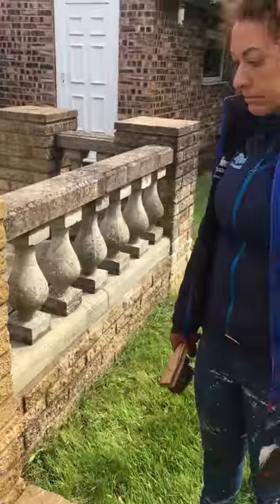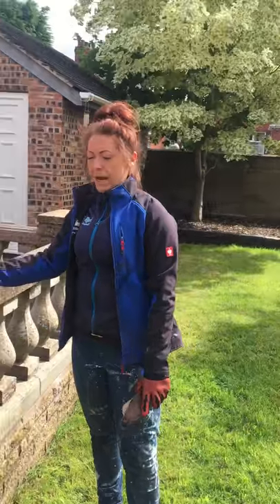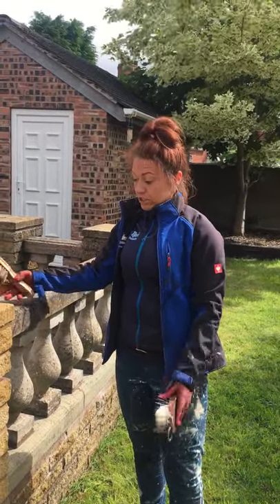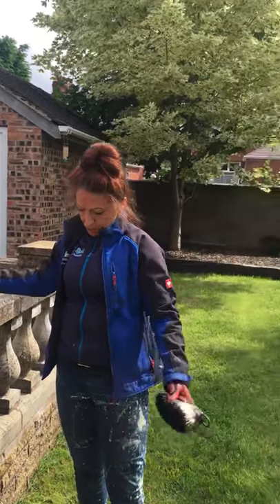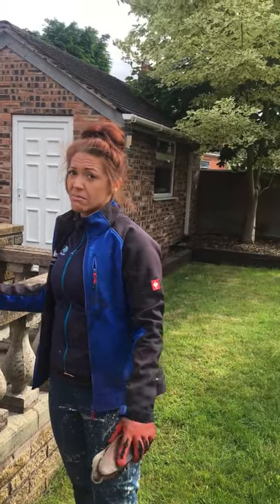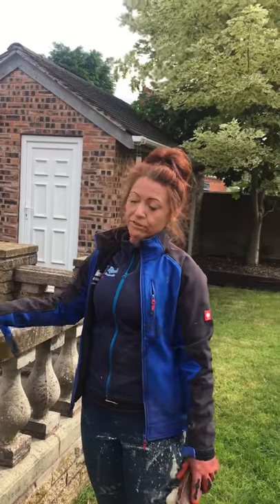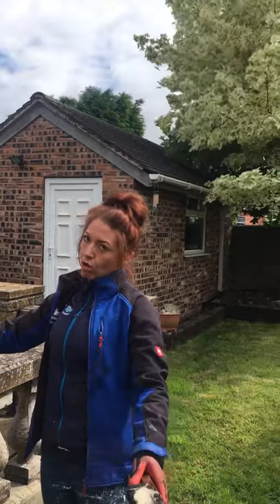So tell me, why wouldn't you pressure wash this? You wouldn't pressure wash it because it's already extremely porous — you would make the biofilm 100 times worse. The spores would just multiply and carry on, and it would be blacker before you know it in a month. And I guess damaging to the stone at times? It's very damaging because anything that takes a layer off the stone makes it more porous and damages it. It erodes it effectively, just like a cliff. So hence why a biofilm forms in the first place — to protect from erosion.